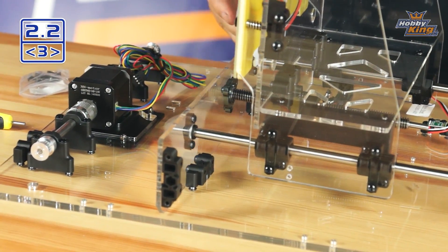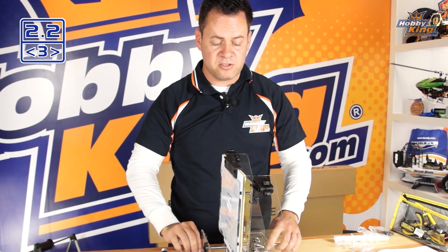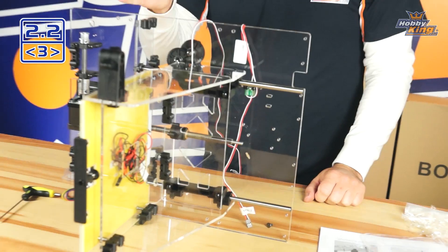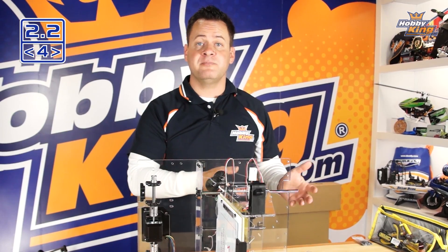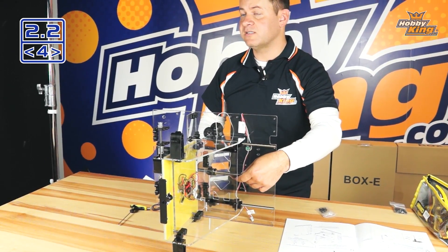There is a lot of weight being flexed on this piece of acrylic. It will take it, but if someone were to bump or jar it, it could damage or crack the backplate. So at this point, turn it on its side so everything is supported. We're now at step 2.2.4 in the manual — go back to Box G, grab some more hardware for the next step, and we'll be attaching the mount point for the bottom of the lead screw.